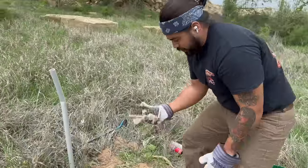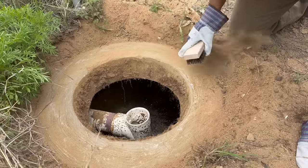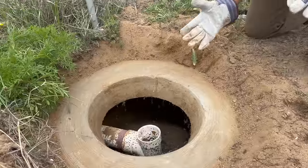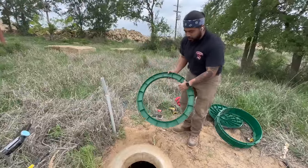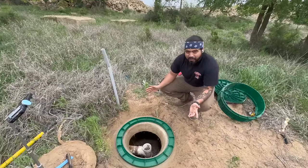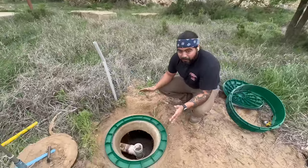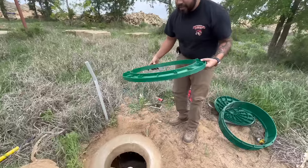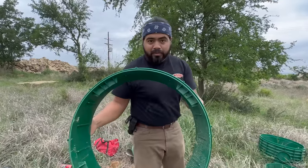I'm going to do a little extra prep and get a wire brush to clean up where I'm going to drop this riser. We've got a nice spot to put our riser now. What I usually do for good measure is get the hole dug up and go ahead and place the tank adapter to make sure I've got it all lined up. Sometimes you have to make the hole a little bigger, so you don't want to discover that once you've already got everything put together. Make sure it'll fit first before you start getting out the sealant.